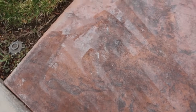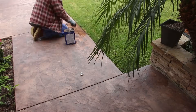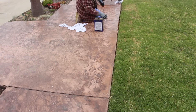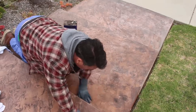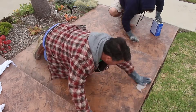In that case, what I do is use straight acetone with some clean rags and a little scrub brush to loosen up that top coat of the sealer and wipe it off. Those two landings were in bad shape — there were a couple of spots, but mostly the two lower landings and a little bit along this edge. You can see I'm wiping it off with some acetone. What the acetone does is it breaks down the top coat of that sealer, so I can wipe off a little top coat of the sealer along with the hard water deposits at the same time.